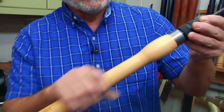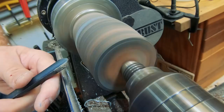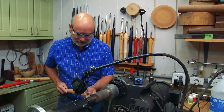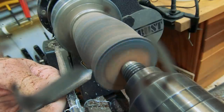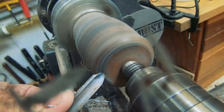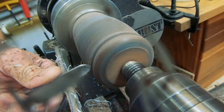I'm also going to be using a Robust spindle gouge — they're starting to make their own line of tools and I'm very happy with them. They're really high quality, hold a really good edge, and I've had a lot of fun with them. I do like getting back to a wooden handle. Looking at this, we're kind of making a bell shape — not a typical bell though, because with a Banksia pod it's like Forrest Gump said, it's like a box of chocolates. You don't know what you're going to get. I'm going to make the bell part with a little lip and then swoop in and back out where the fat part of the Banksia pod is. Now we've got both sides of the bead.